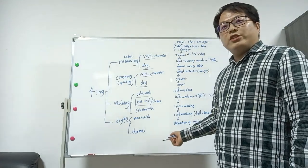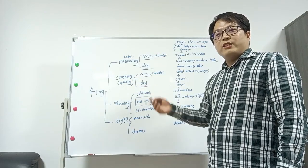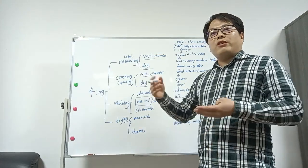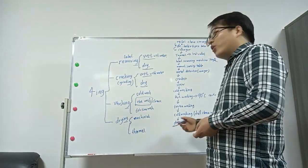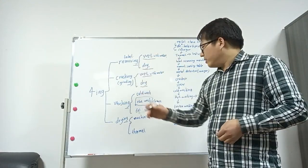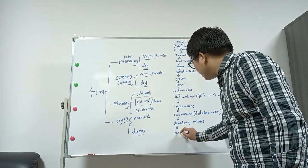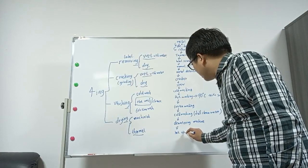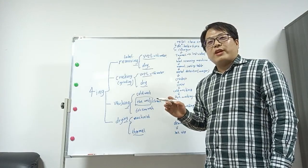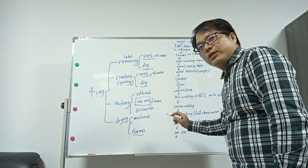The dewatering machine uses the centrifuge to dry, and this function is very good. In sum, if you directly store the flakes, then the dewatering machine is okay. But if you want to go directly from washing to pelletizing, then you need the thermal type, using hot air. Hot air dries the surface water to get drier flakes. After this, we also can have the zigzag.